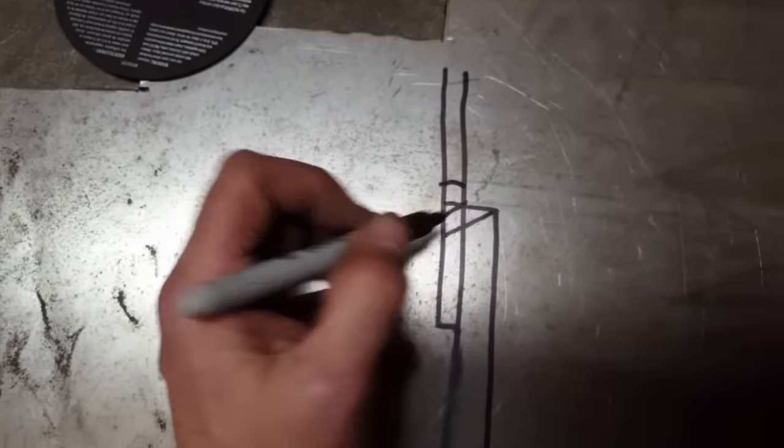That is a bit of a strain on it, yes, but that will play into the part. Now, one of the advantages of doing it this way is that all of this is still held out on the panel. By pushing on this here, I'm not caving everything in. I'm using this just as a starting point in this corner. I usually start on corners all the time, it's so much easier, and I keep everything square.